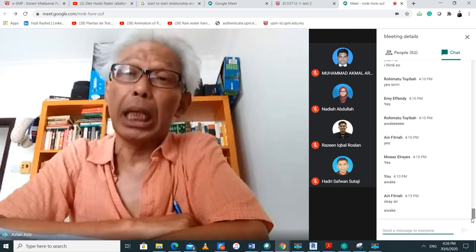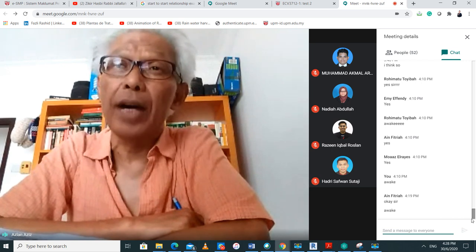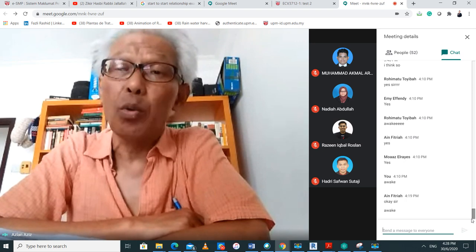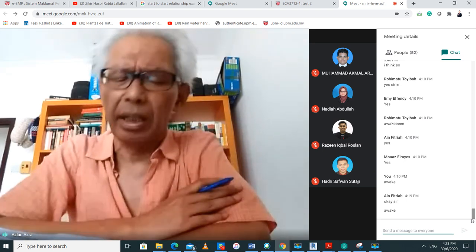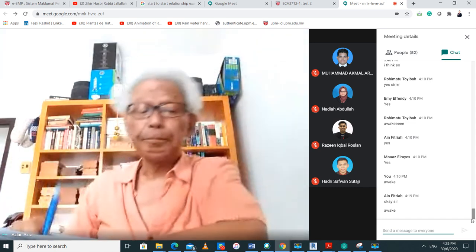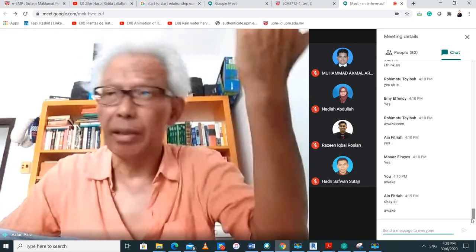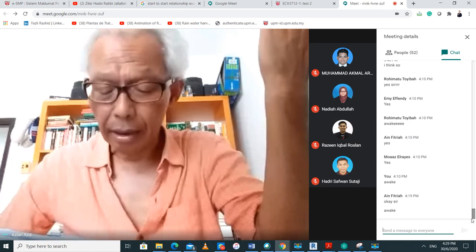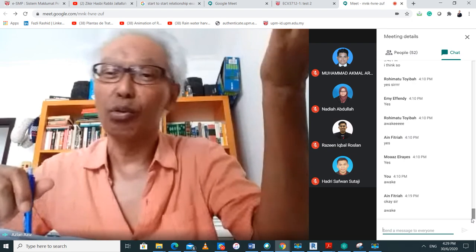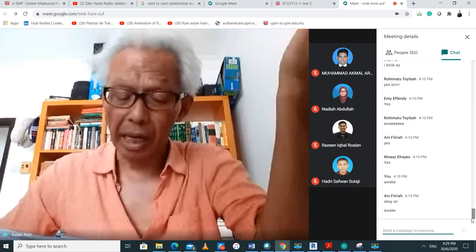Now, C sub A is equal to alpha C sub U. In other words, the ratio alpha is equal to C sub A over C sub U. All right, so this alpha depends on the type of clay, whether it's soft clay or stiff clay, and on the pile installation method, whether you have small displacement or large displacement, whether you drive it or whether you have it cast in situ, bored pile, okay?